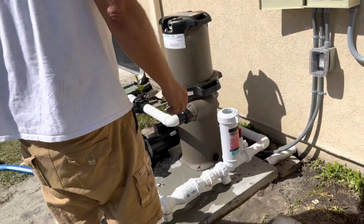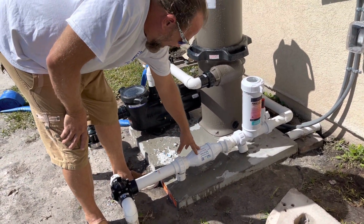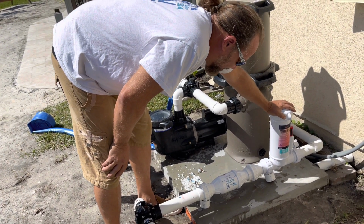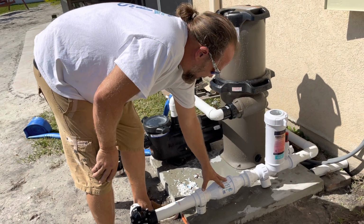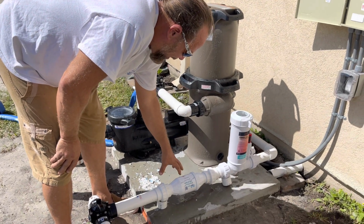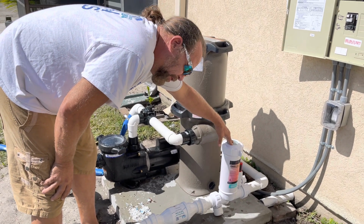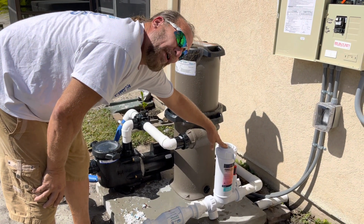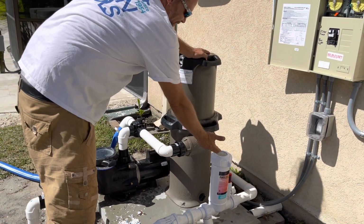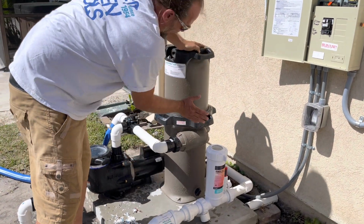This right here is called a SmartGuard Soft and Clear. Okay, it's made in the USA. It's a sanitation device, so it's a chlorine reducing device. So you've got chlorine in here. That's what you've chosen to sanitize your pool with, is chlorine. Well, this guy and this guy, they attack algae and bacteria, softening them, killing them, making it easier for chlorine to do its job, which means you can run lesser amounts of chlorine and still have a crystal clear blue pool. Science hasn't gotten so fantastic that you can do away with sanitizer completely, but they've almost gotten there with this guy, and you're going to learn more about it, and you're going to learn more about your filter.